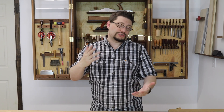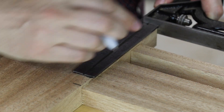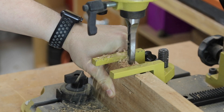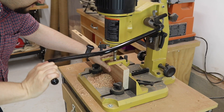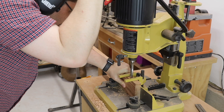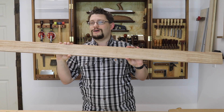One of the first things I did this week was I needed to cut the mortises in the rail, the top and bottom sections. After marking everything out, I headed over to the mortiser with a 3/8 inch mortise bit. It was actually the first time I think I've ever used outfeed support for the mortiser, and the reason for that was these parts for the mirror are just so long — they're 5½ feet long for the top and the bottom. So that was kind of funny.